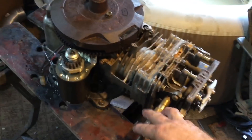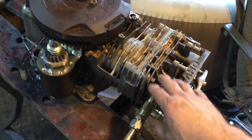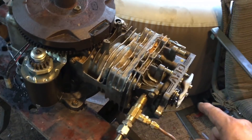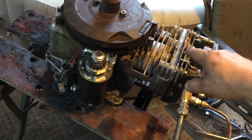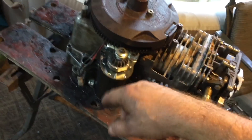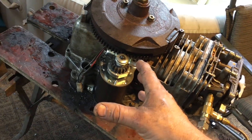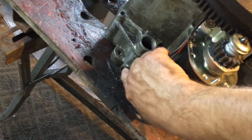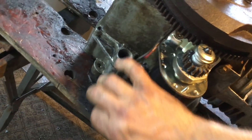The oil gets mixed with the steam to lubricate the cylinder and bearings. The steam and oil exhaust into the crankcase, putting a spray of oil on all the moving parts, and then I let the condensation drain out of the old oil drain plug — water drains out, oil sticks to the metal parts.